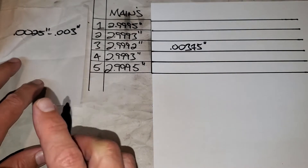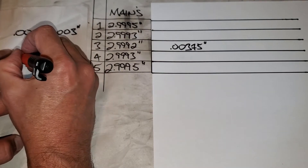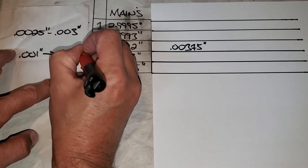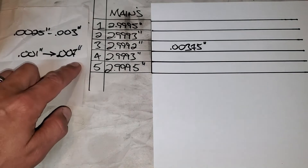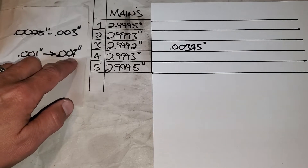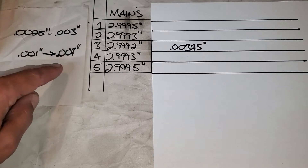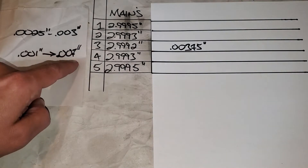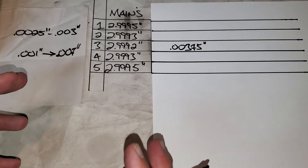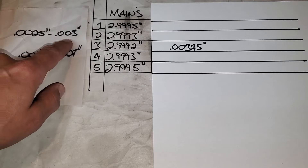The reason is, if you were to build a Pontiac engine, the book says one to seven thousandths is acceptable per the Pontiac spec. But if you were to get an engine built to the high range of the spec, you would have little to no oil pressure at idle — or even at RPM — that's too big. As you get a more performance-equipped engine, you're going to have to start tightening your range to the lower end of the scale. That's how these numbers came about.